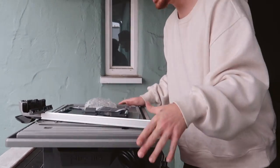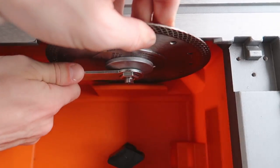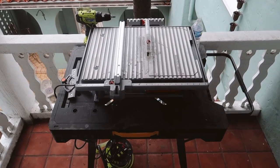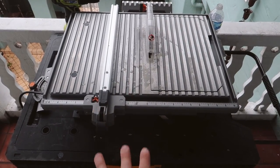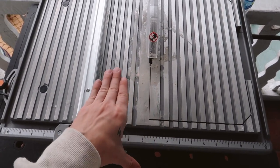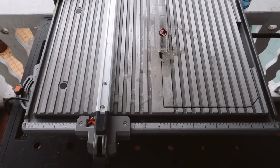Here is the tile saw. Something interesting about tile saw blades is they are not sharp at all — they actually grind down the tile and stone as opposed to cutting it like you would wood. The tile saw is set up just outside on the balcony. We did a practice cut to make sure it was working and it worked great, though it does take a little bit longer than I expected — you have to push through slowly and apply quite a bit of pressure. I do have travertine tiles which might also be a harder stone to cut.